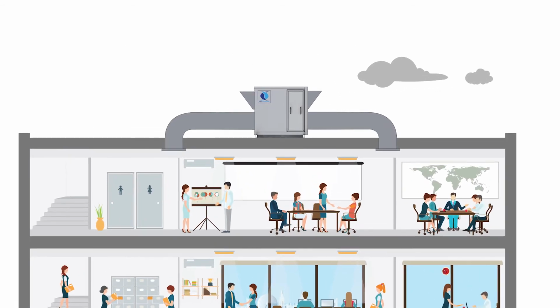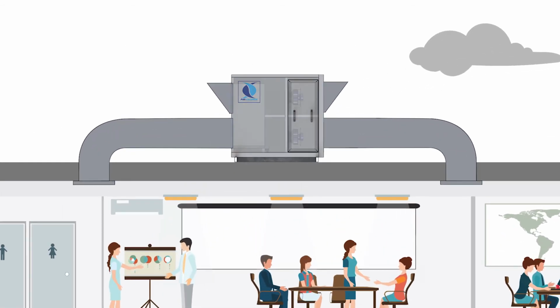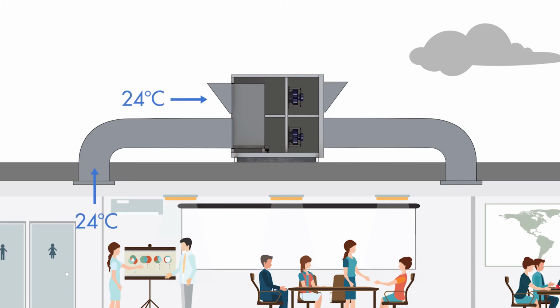Despite saving large amounts of energy seasonally, there are certain conditions where heat or energy recovery is not desirable and should be disabled temporarily for optimal performance. For example, what happens when outdoor air conditions are at the desired indoor condition? Then drawing air through an air-to-air heat exchanger will provide no temperature benefit and will only add an unnecessary pressure drop, which increases fan power consumption.